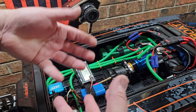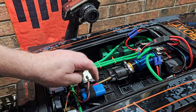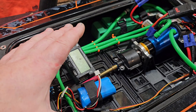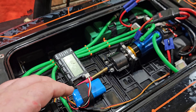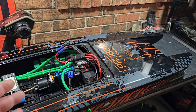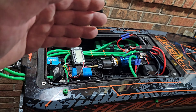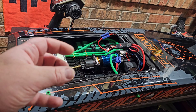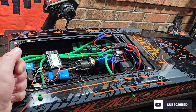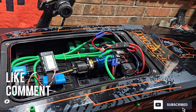That does make sense — the battery's completely discharged but has had a second to come back up a bit. I definitely think it was the discharged receiver pack. It didn't sputter, so I'm not even going to bring the other one out. I know that's what it was — I storage-charged this battery and ran it that way, it wasn't fully charged. It happens to the best of us. I've storage-charged batteries before and brought them out in a hurry. We'll take it out tomorrow to the park pond with a fully charged battery and confirm. It's gotta be it.